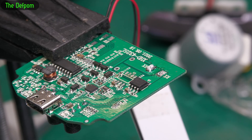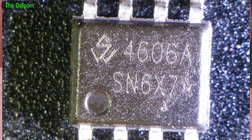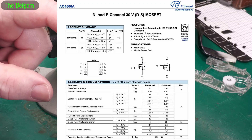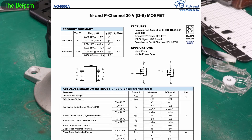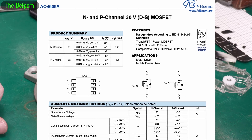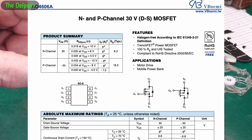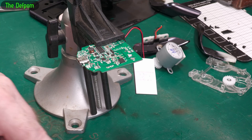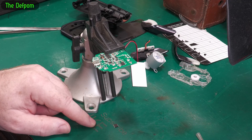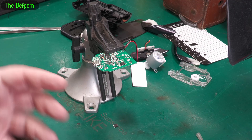Let's see if I've got a MOSFET I can put on there. The original MOSFET is marked 4606A or SN6X7A - I'm not sure which one it actually is. Apparently this is a dual MOSFET - an N and P channel in the same package, so you can do push-pull within the same device. I haven't come across those before. I need to get some of these - they are available but I don't have any on hand, I've only got plain types. So I need to be careful because these are a bit different. I can't continue until I get those parts.